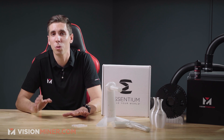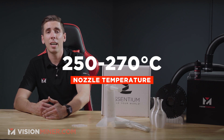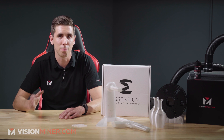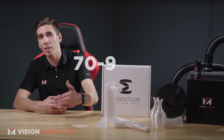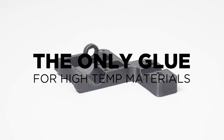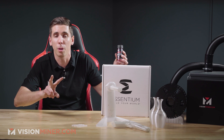Let's get into what kind of machine you need to print this filament. You've got to have a nozzle that goes up to 250 to 270°C, so just about any machine can print it. If you've got an Ender 3, CR10, Funmat HT, or an Aeon M2, you can print this and it prints as easily as PLA. On the bed, you need about 70 to 80 degrees Celsius, and our nanopolymer adhesive works fantastic on every surface we've tried.